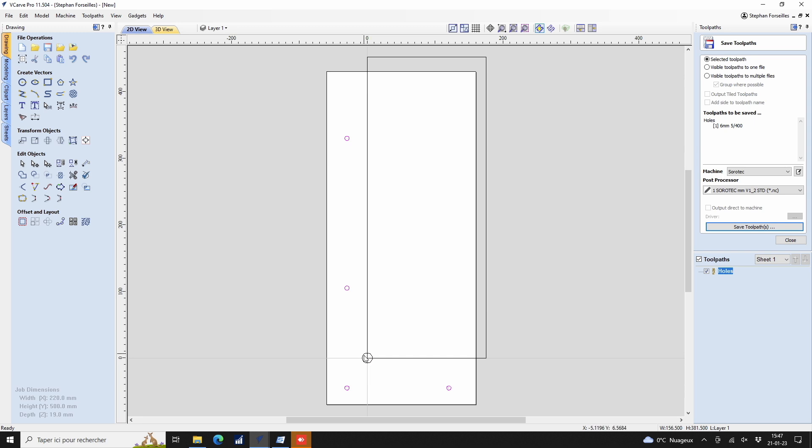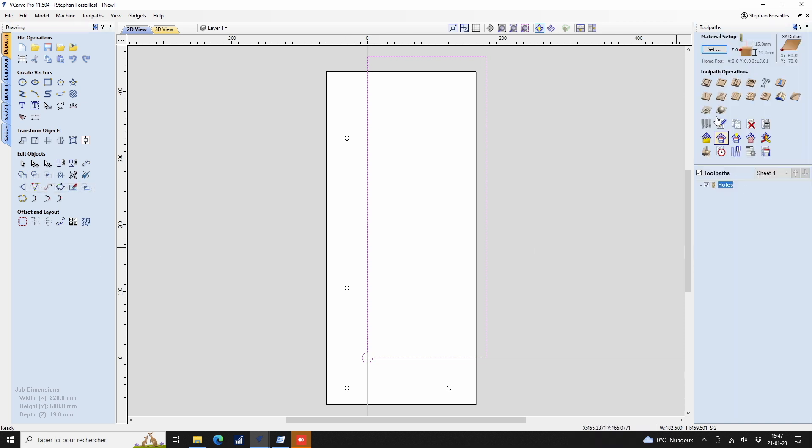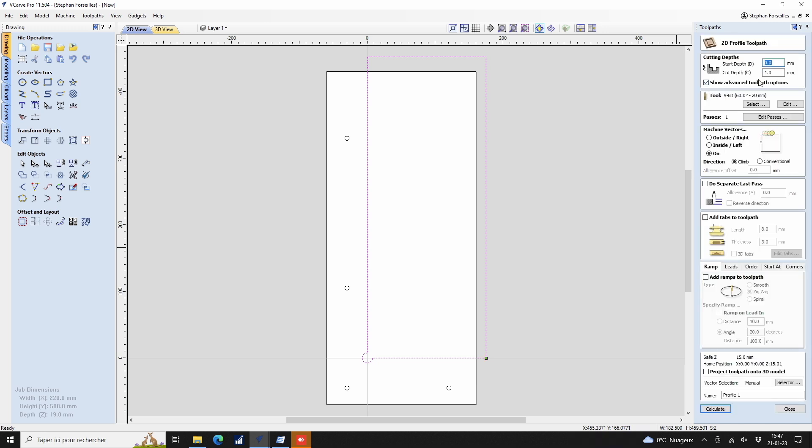So I'm going to join those two pieces together. You remember we cut a small rounded figure there so we don't have dust settling in the corner of the cutout when we place our pieces in the jig. So let's join those — there we go. And we're going to make a toolpath — we're going to cut 19 millimeters, that's the thickness of my MDF piece, inside of the design.